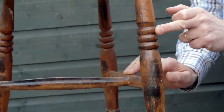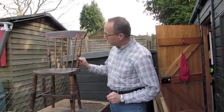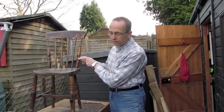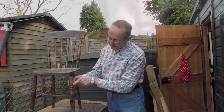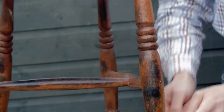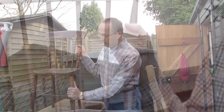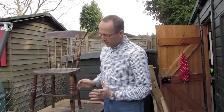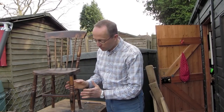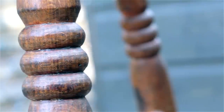The turnings are replicated very nicely on the uprights here — it's like the leg reversed. You've got the three Wycombe bead turnings and then the single turning on the legs, the same three Wycombe bead with a single turning. The legs and these upright poles are all hand-cleft wood — that is, someone's gone into the woods, a bodger's gone into the woods, cut down a tree, split it up, and turned all of these on the pole lathe.